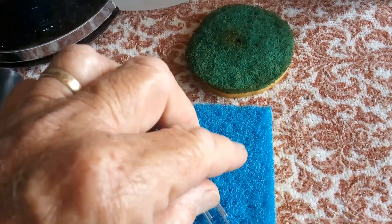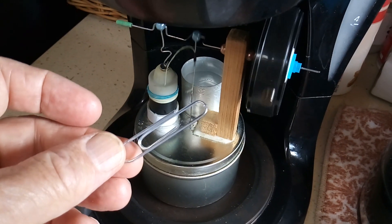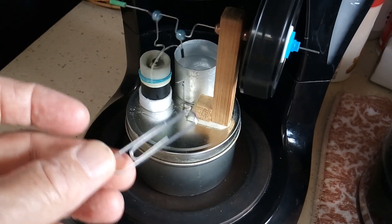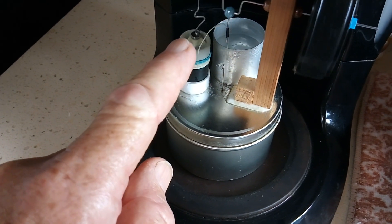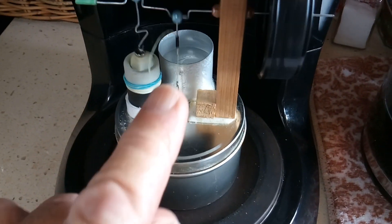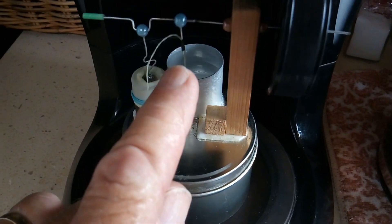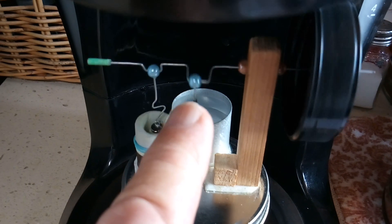You just make another one when it burns out. All the rods and shafts and everything are made out of paper clips straightened out. That's a latex glove tip there with a couple of small magnets — one inside, one outside. The adjustment is a thread going through a piece of wire insulation that goes around the paper clip shaft.